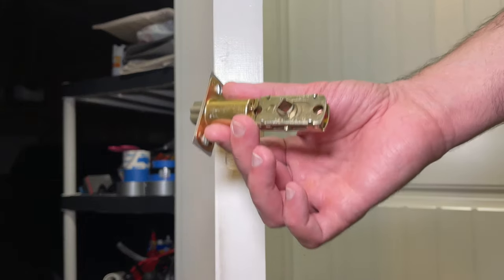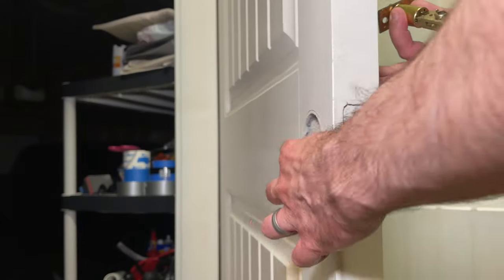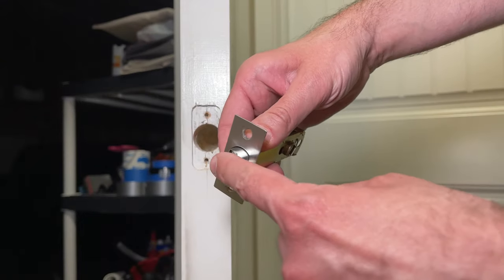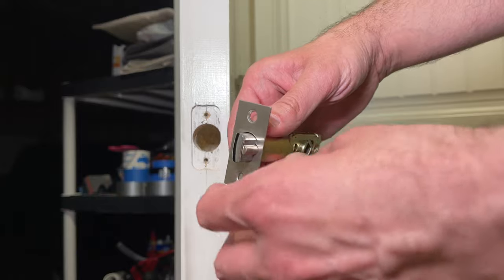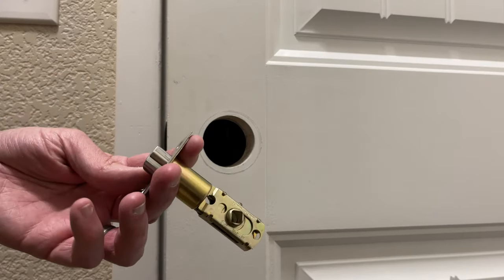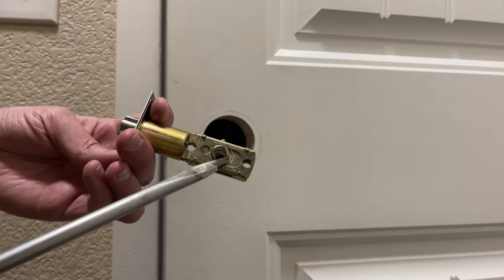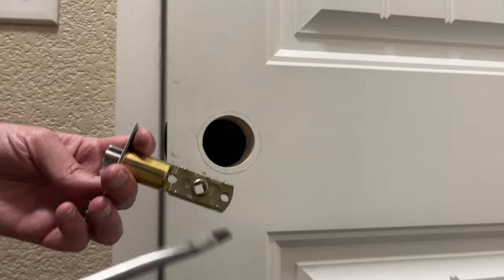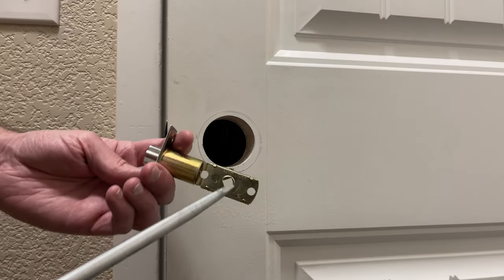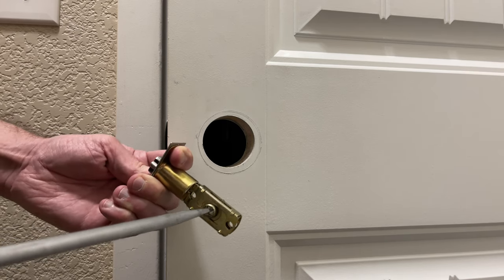So the first thing you're going to want to do is install your door lock. We need to make sure that the little hole here lines up with the hole where the door lock is going to go. When you install this, make sure that the curved edge is going towards the door so it closes easily. Another thing you have to be very mindful of is when you're installing this door lock, you need to adjust this little hole here to unlock the proper way. So if your door handle is on the left side like mine and it opens towards you, you want to put a screwdriver or something in here and turn this all the way to the right.